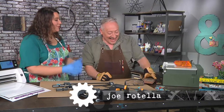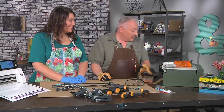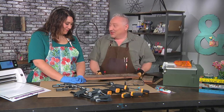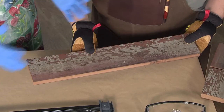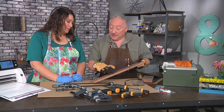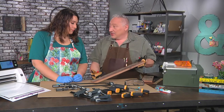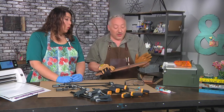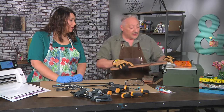You're going to show us how to make it too, right? It's easy to make. This is actually a piece of redwood fence that I took down from my backyard. It has this beautiful distressing that's real, not fake, from years of being outside. It was a little wider, but the edges were kind of chewed up from being a fence for 50 years, so I did a rip cut. A rip cut is when we're cutting with the grain, and that's when you use the fence.